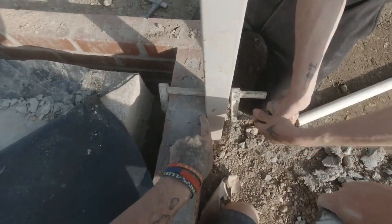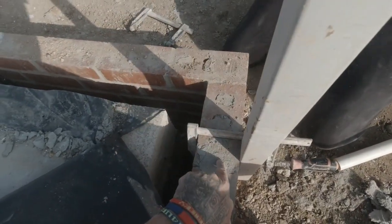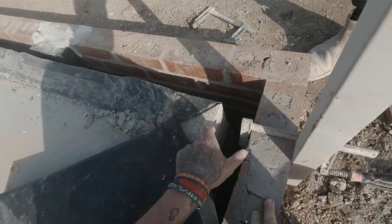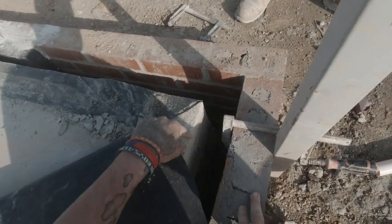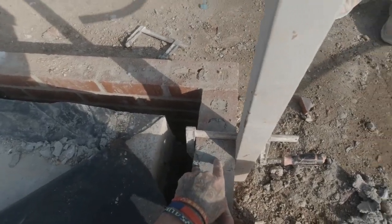We've set this up here, 307, that's our overall cavity size. So this is face brickwork, this line will be face blockwork, but run through there. Obviously, we've got the gap for the cavity there. We'll start from here, 100 mil back on this one, but that's the overall.